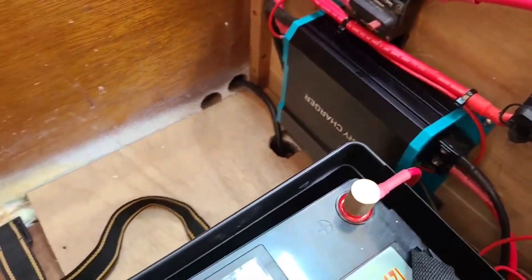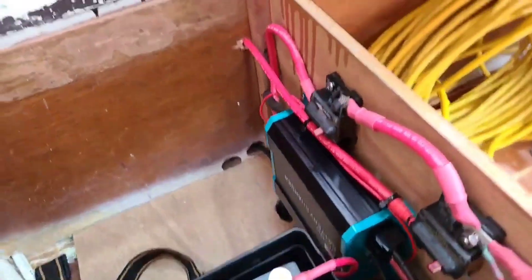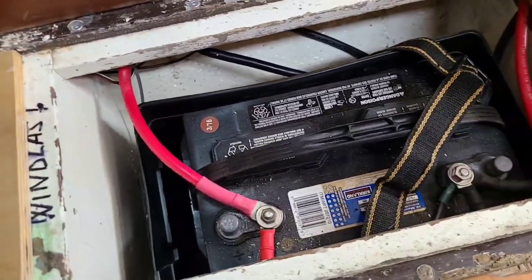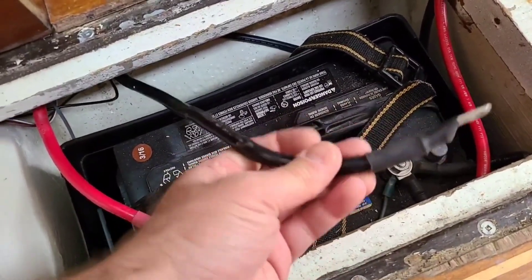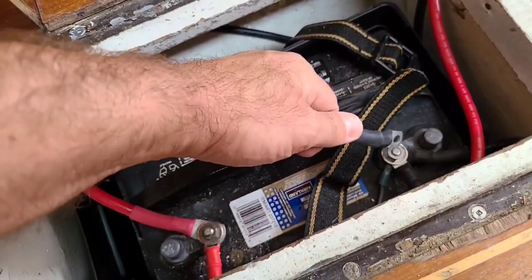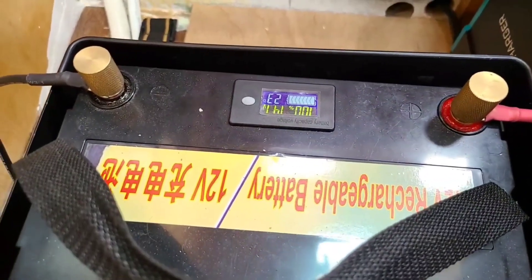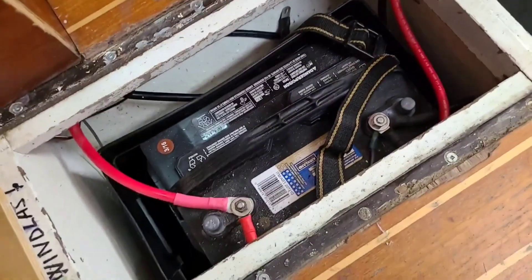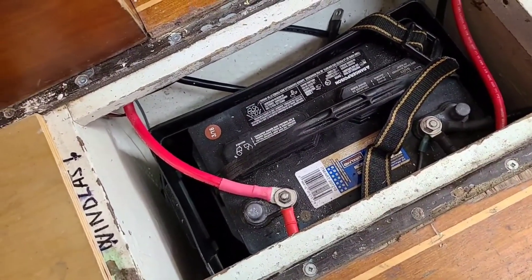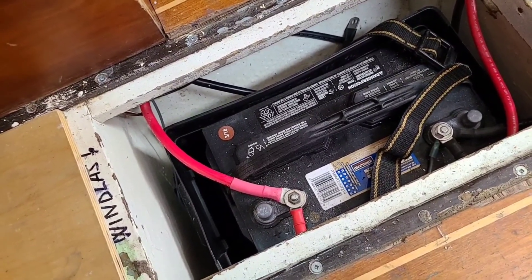I have a feeling that I don't actually have power. So I measured the input voltage and figured out I don't have 12 volts in. I finally traced it down to a disconnected minus wire from the windlass battery. Let's try it on — yeah, there you go! The light and fan came on and the voltage jumped up a little bit. Interesting — this sounds like it was the primary issue I had in the past and why that battery wasn't charging.